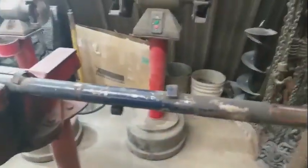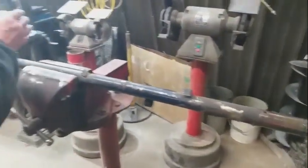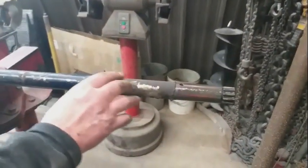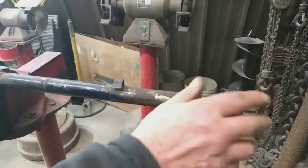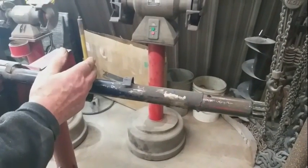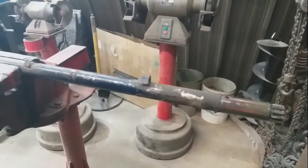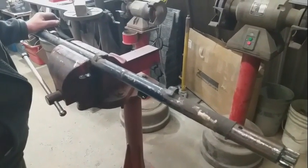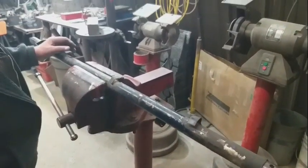The column has to be cut because there's a steering wheel, a motor, and a U-joint going in, and this part connects back into the steering assembly in the front. The beauty of the setup is that if the power quits on the power steering, you can still drive the machine home because you still have manual steering. Right now there's just too much pipe and it needs to be cut and fitted.